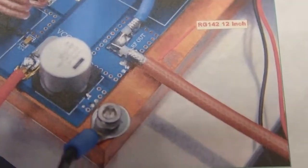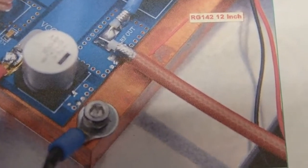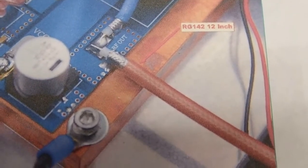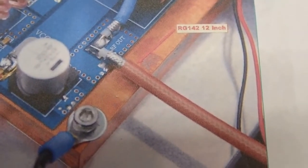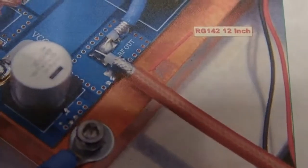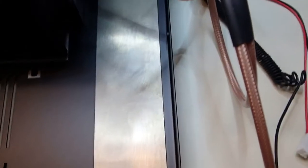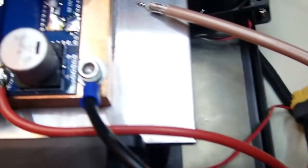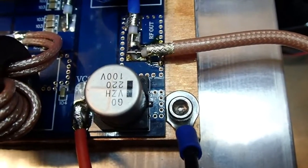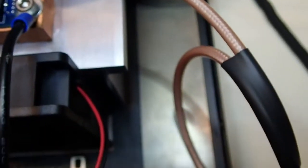Now on the bottom of page 13, a 12-inch piece of RG-142 connects from RF out on the power board to RF in on the low-pass filter board — this is going to be the trap. We solder one side of the trap onto the RF out right now. Here we have the trap tied to RF out on the main power unit board.